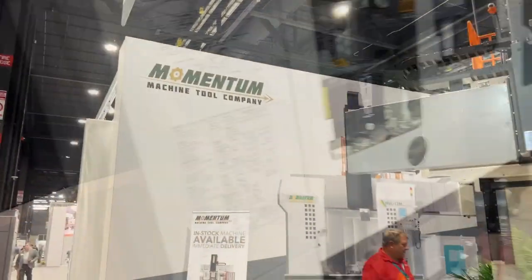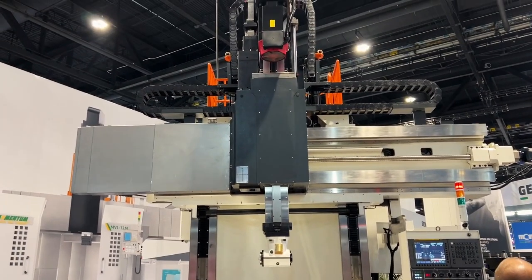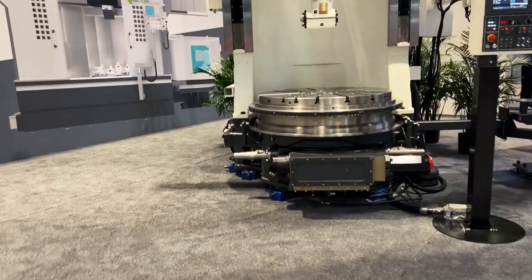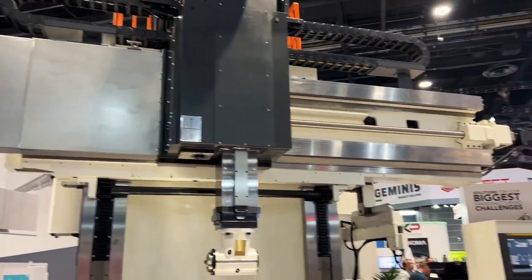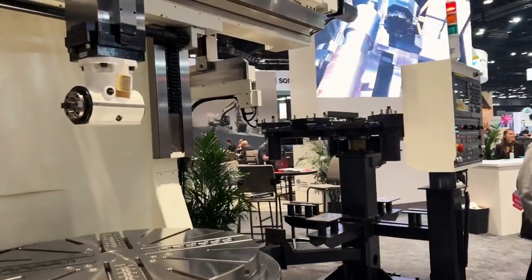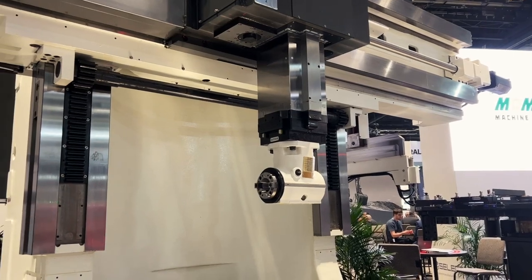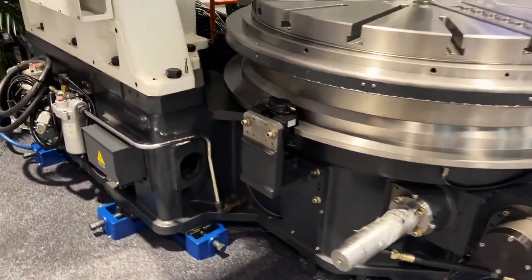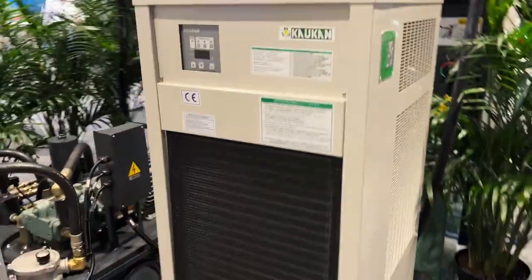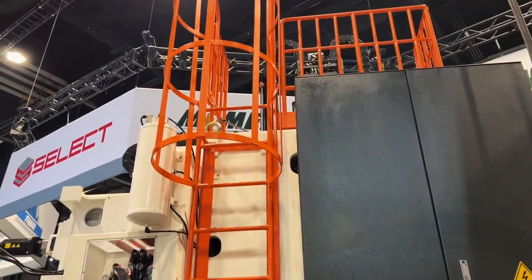I'm here at the Momentum Tools booth and they have a very large-scale VTL. The coolest part about this machine is that the covers are off and you can see the spindle, the worm gear, all around the chuck, the rack gear for the axis to move up and down, the box ways exposed, and the ball screw. This thing is running a Fanuc control and it even has an automatic tool changer. The 90-degree head in it is pretty impressive because it means it has a live head. You can see the spindle motor, leveling screws, and the casting — probably a lifting point. It likely has a spindle chiller and a column cooler. And if your machine requires a ladder, it is a big machine.